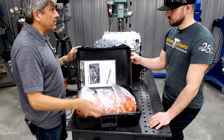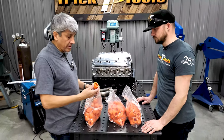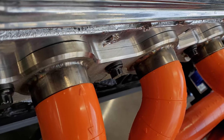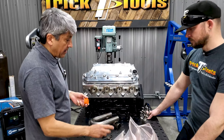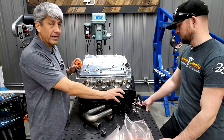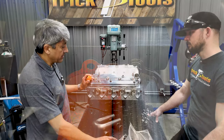We're going to use only three shapes: a straight block, a two-inch centerline radius block, and a three-inch centerline radius block. The first thing we need to do is make sure we have a flange with starter tubes and a solid location for our block so we can start connecting it to our desired location in the collector dummy. You can also use a regular collector or a slip-type collector. We developed this part simply to ease the trouble of finding the right location and creating a solid fixed point where we're going to be landing and reviewing our design.